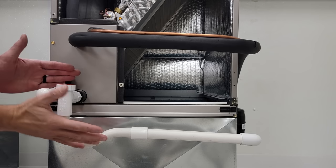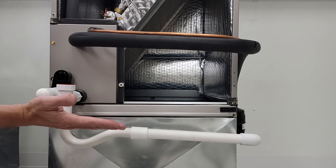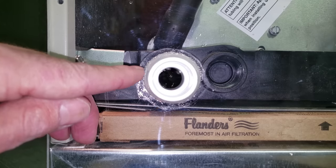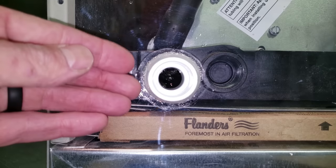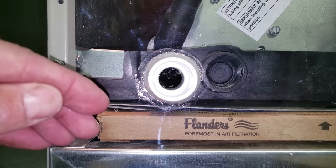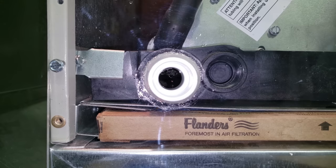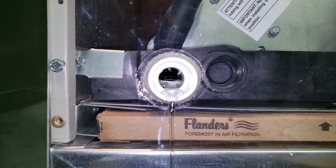There will be no trickling of water coming out unless this trap is filled with water. Here we see a running air handler with plexiglass on the front cover and no condensate trap, so you can look inside the PVC line and see that the water is rising. The air getting sucked into the pan won't let the water drain until you shut the power off.